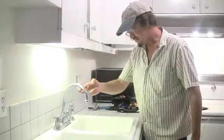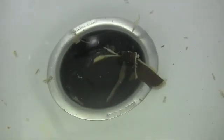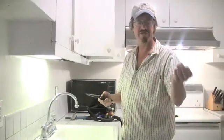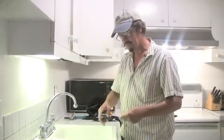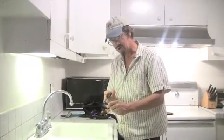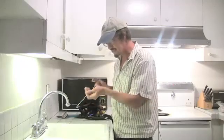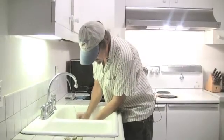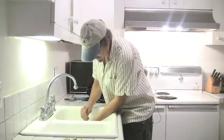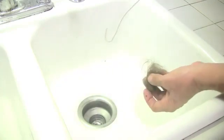But now on this side, this is just a regular sink drain, and there's something down in there too. We've got a piece of wire here — this happens to be 12 gauge electrical wire, but almost any kind of wire will work. A little pair of pliers and we just bend a hook right in the end of that thing. So now we've got a special tool; we can slip that right down inside and start working our way down, fishing around, and with our little hook we're able to pull it out without taking the whole sink apart.